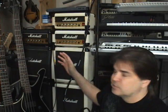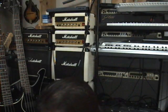So you have to look up what that particular model that you have puts out. That's why you're not actually getting the 6.25 watts per speaker cabinet. If I said you're running four speaker cabinets off of one head, you're getting more than that because now the amp is actually delivering a lot more power. Okay, so you have to look up those things and then remember not to blow up your stuff, but see what the actual wattage output is at each ohmage rating.